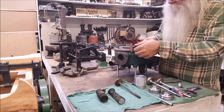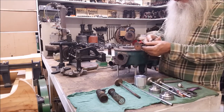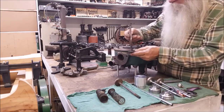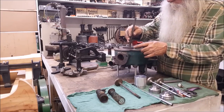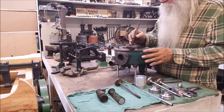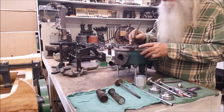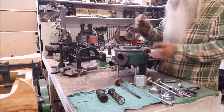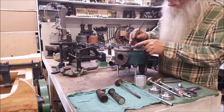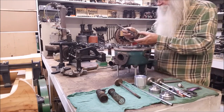You can see it build up a carbon pile right there. That's the flow of that gas, you know. Now, that's the reason you want to index your spark plugs. Right there is a perfect example of flame front. You know, if you're inside a building and a gasoline explosion happens down at the end of the building, you want to be standing behind a pillar. You know, it don't just go all at once, it comes to you. So that's the thinking behind that index and the spark plug. And this confirms it right here, the flow of that gas is going out of there.